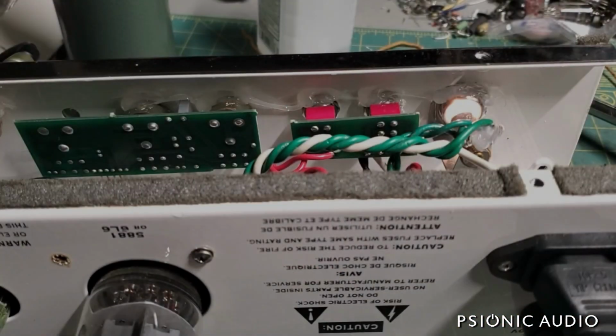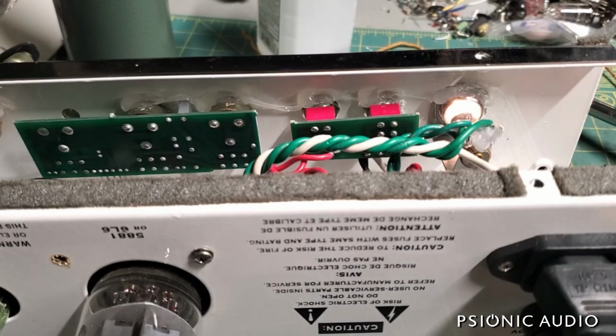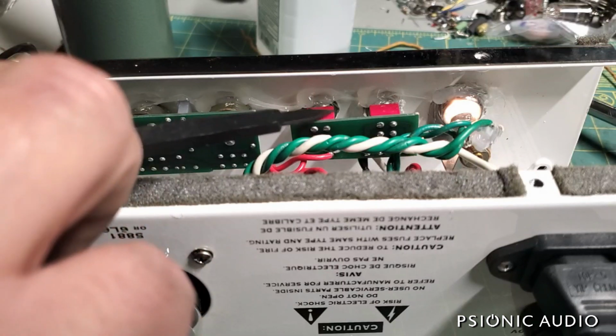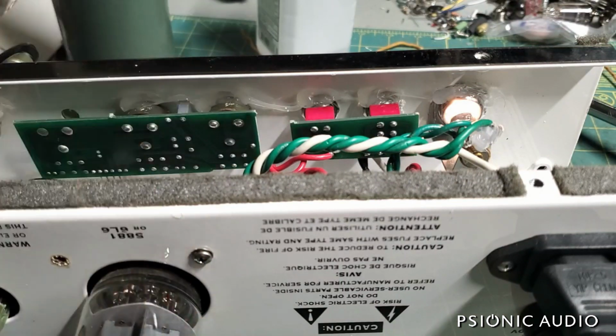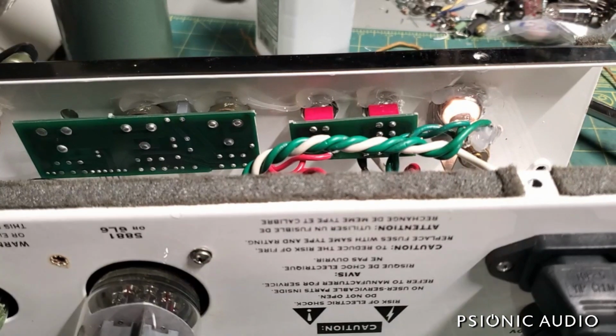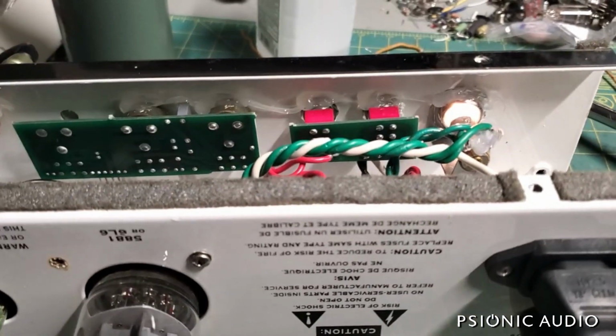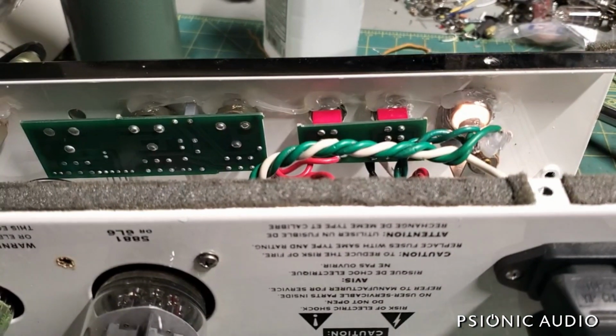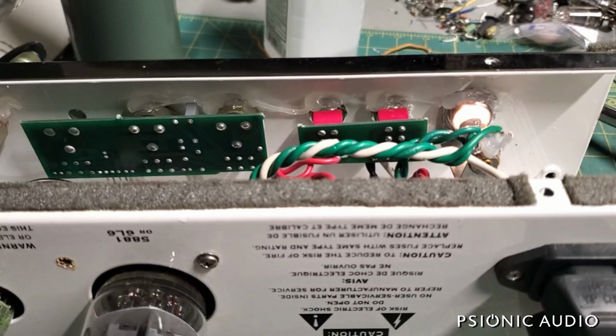Well, I don't know if I'd recommend this amp to anyone, given the way it's built and the very cheap pots and the very regular, inexpensive switches that are disguised on the other side as full-size Carlings, etc., etc. But, you know, it works now. It doesn't blow up. Take my current limiter off, give it the full power. I had the wrong fuse in it too. I had a 2.5 amp fuse. Now it's got the correct 2 amp fuse.